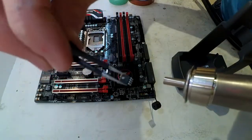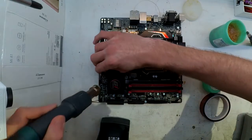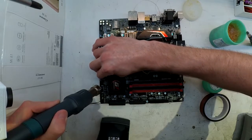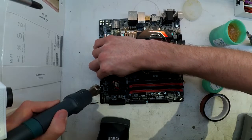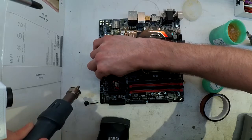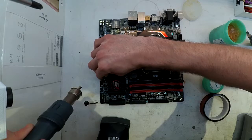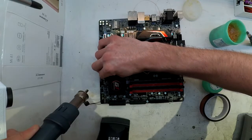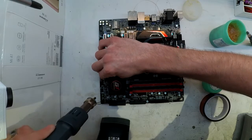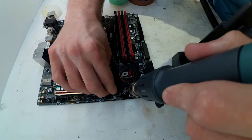As you can see here, I've just pulled a BIOS chip off a Gigabyte motherboard. I've only played with this for about five minutes and it was a piece of piss to remove and reattach that BIOS chip — purely turning the machine on, sticking it at 325 degrees and a flow of about a hundred, then off and back on quite easily.